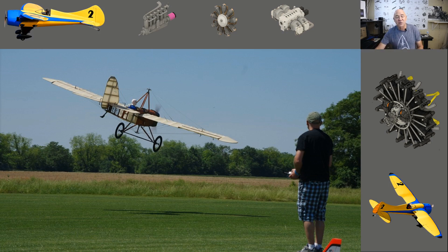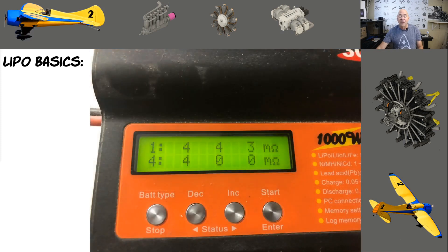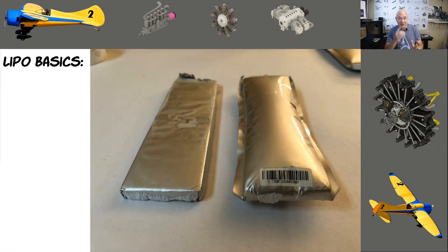Friends Burger, Amen, and Dean got together and lent me battery packs so I could fly the festival that week. About six months later, I was flying a pack and it swelled up really big in the middle — like a Big Mac. When I took it apart, it was a single bad cell. That cell had an internal resistance reading of around 45, while the others were around 3 or 4. One bad cell in a pack will affect the entire battery's performance — it sucks the life right out of it.